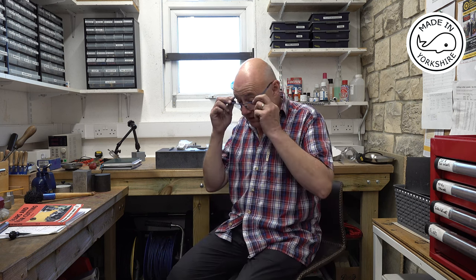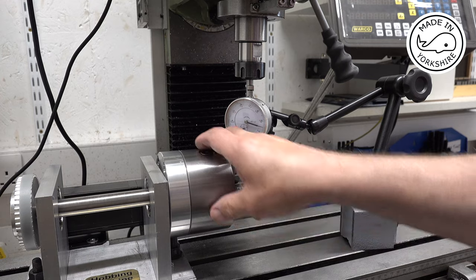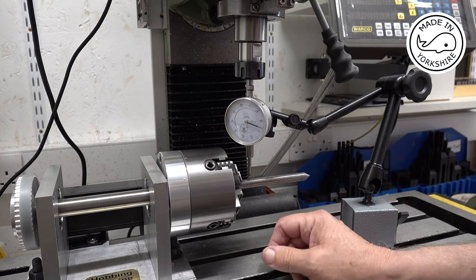Hi there. I'd like to thank everybody for the help, support, and advice regarding my current hobbing machine problems. I got some fantastic advice when I published my last video, and a lot of people suggested that I need to look at machining basics, stepping back and making sure that everything's held down correctly, no vibrations, offering tailstock support, and basic stuff like that. In this video I'm going to revisit all of that and put this four-jaw chuck on the spindle to make sure there's absolutely no run out.